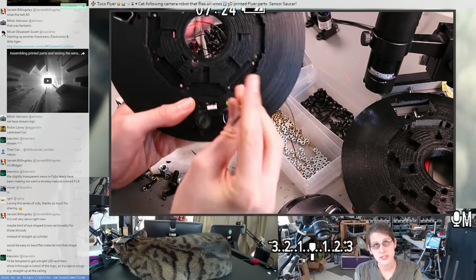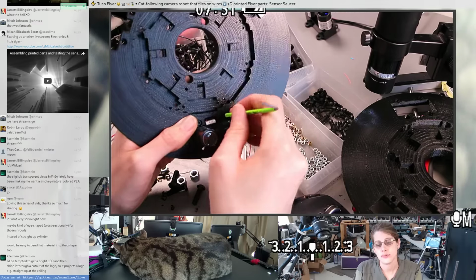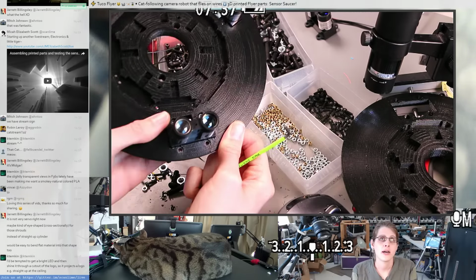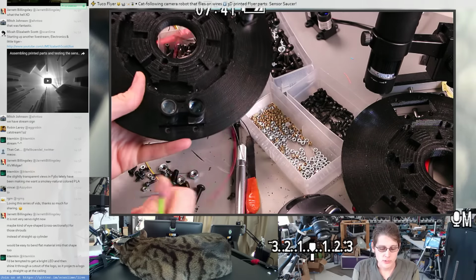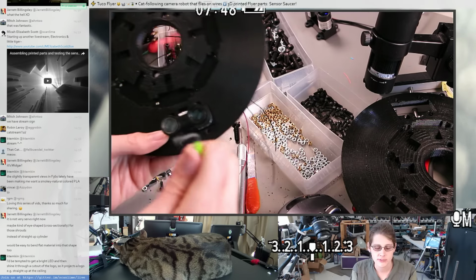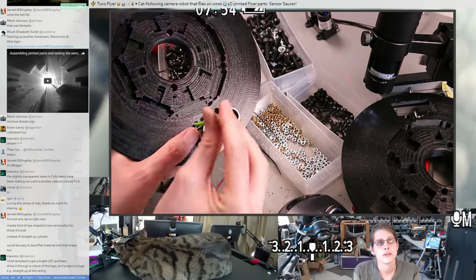But yeah, I was experimenting with a few different designs for this sensor saucer, and I really like this particular layout that ended up allowing it to be so thin, where the LiDARs mount through from the bottom, but then the IRs press in from the top. I was trying to keep this level from sticking out too far because then I worry about it getting in the way of the line of sight for the IR sensors and having false triggering based on reflections off the side of these.